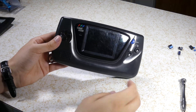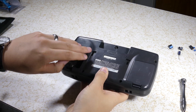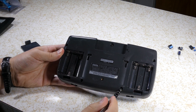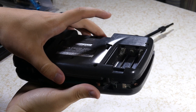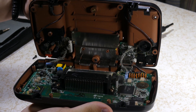This project is not for the faint of heart. The disassembly of the Sega Game Gear is pretty straightforward. First you'll need to remove the battery covers and any batteries inside. Remove the six screws on the back of the Game Gear and the large security screw. Carefully pull the two halves apart, swinging the back up so as not to yank on the cords attached between them. Unplug the sound and power boards.